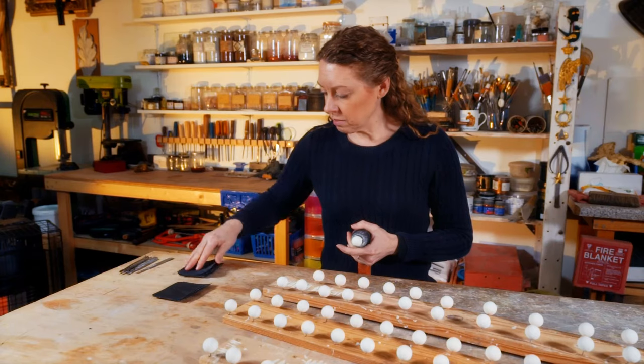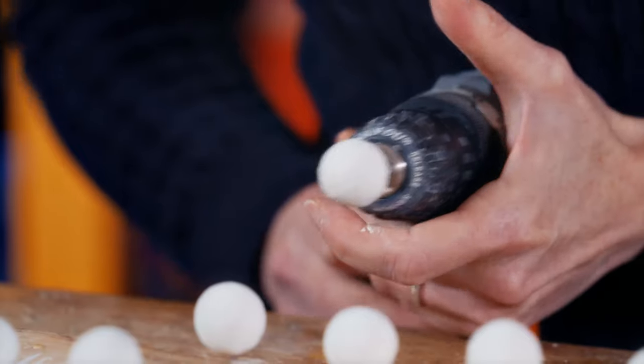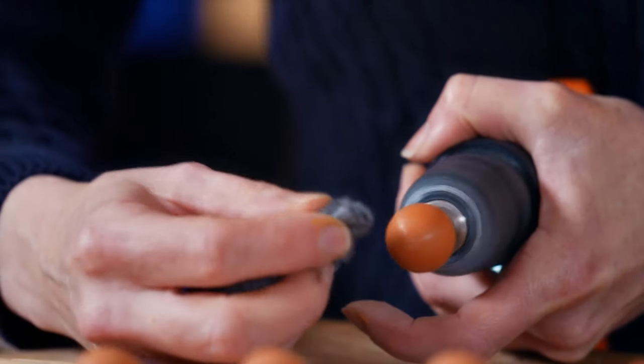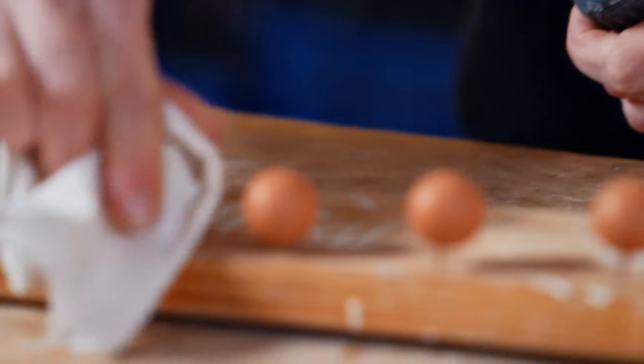So I get a drill and my sandpaper — I'm using an 80 grit, so it's really rough — and then let's sand it. No lumps in that, that'll do. They've had their eight coats of bole. Now what I need to do is just get rid of the brush strokes. And this is now really shiny — that's ready for gilding.